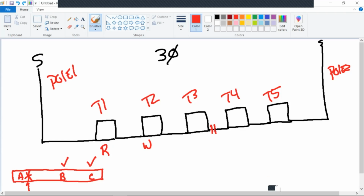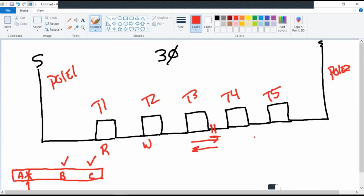You cannot backfeed when you get ready to restore power. You cannot send power from one dip of any one or two phases and from another dip of any two phases across the open point. Do you understand what I'm saying there? It's either all three phases feed one direction or the other, or none. Does that make sense?